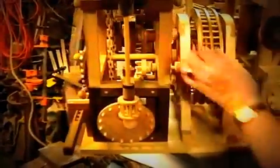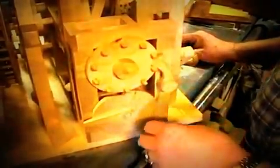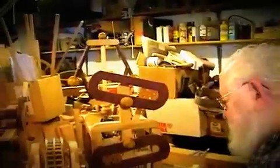And then, of course, these are chains and sprockets. And then this is an escapement here that only turns one peg at a time from the time this thing comes around — it turns it one peg at a time. And that operates this, which makes these turn so they roll. This peg gear works in these holes in this gear here. It's just a chain-tightener here.